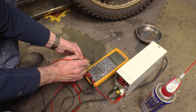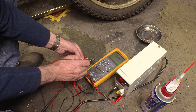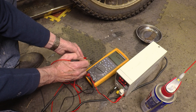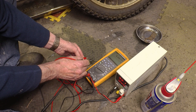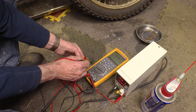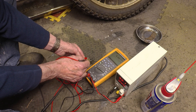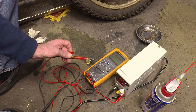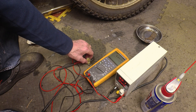Don't get any current to flow at all — well, a little bit. So that's 0.04 microamps. So it's not zero, but I wouldn't call that conductive. It's obviously more than air, but yeah — 0.04 microamps. So that's the WD-40.